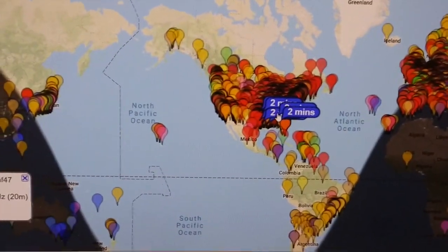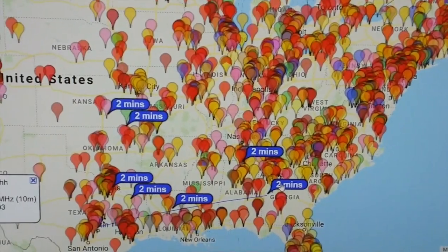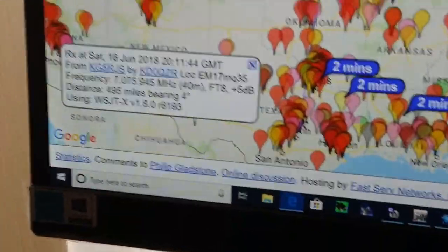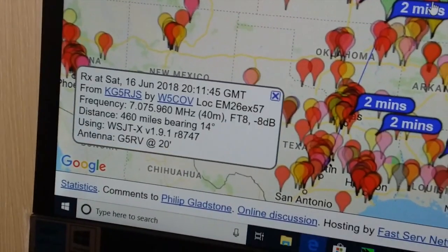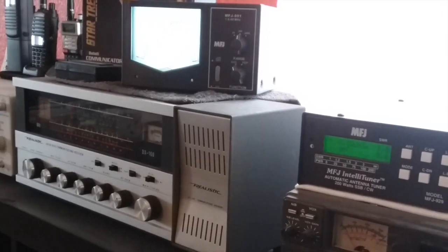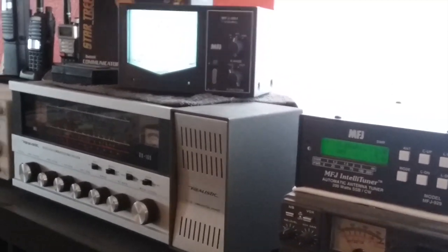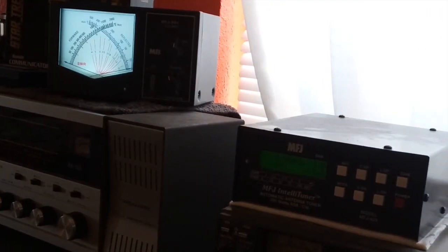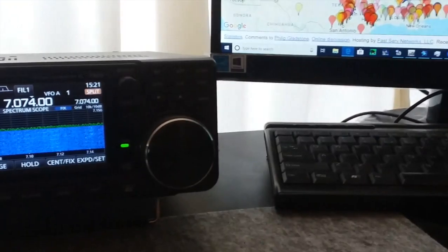There is where my 40-meter signal propagated. Minus 8 dB there, minus 16 there, plus 5 there — very loud in Kansas it looks like. Plus 7 in Texas, looks like maybe San Antonio. So that's good. I'm very happy with this performance so far. I'll do some more videos on FT8 or general digital operations at another time at night when it works better. If I got on 20, I'd probably see South America propagation, Canada propagation, all over the U.S. — probably wouldn't see a whole lot of DX in the middle of the day on 20 meters right now. Thank you for watching.